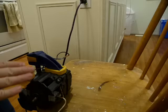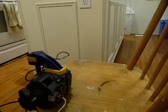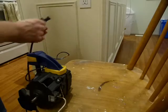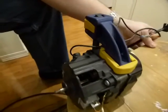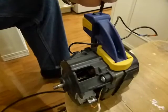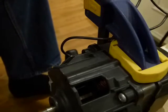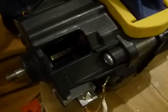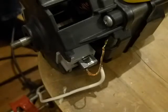I'm sure all the cleanup and disassembly did some good to the motor, though it was totally unnecessary. But since I have it on the bench, let's take a look at how the brushes work — come in closer and you'll see that it's arcing and sparking in normal operation. Let me zoom in — you'll see some blue sparks. That's how the thing works when it's functioning perfectly.